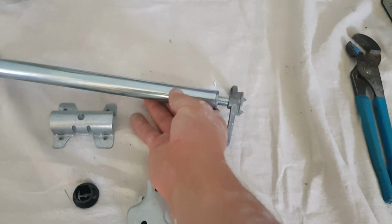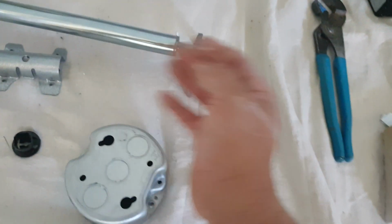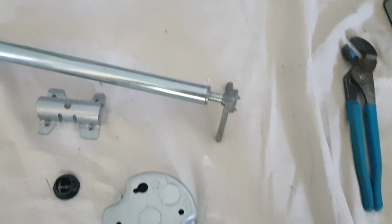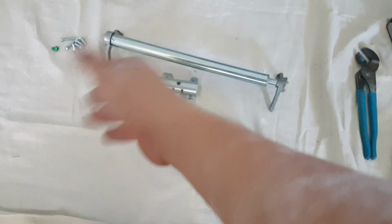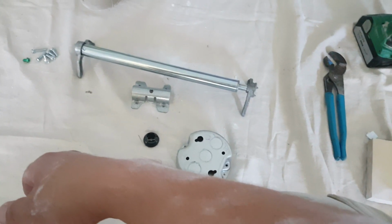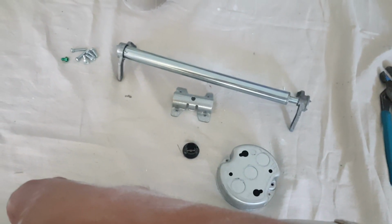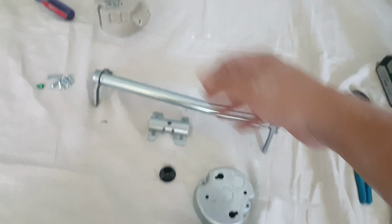By twisting it, it goes up to 24 inches, right? So you want to twist until it hits the wood members there, and they will get attached to the wood members. That way you don't have something so weak to hold your new light fixture, right? Don't throw away the piece of drywall that you took out, because we want to use it back later.